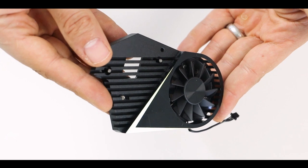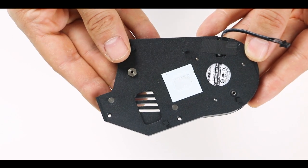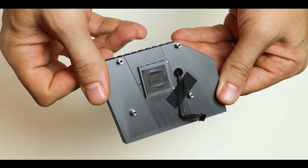They went with a classical double-ball-bearing fan. I don't know how many hours it's rated for — they don't put it on their website, which makes me believe it's probably 20,000–30,000 hours. The heatsink itself is shallow and slight — the exact opposite of what you'd see on a Gigabyte or Aorus board, which shows what an 11-watt chipset really needs: something heavy and thick. It will do the job, but it'll be noisier and less durable.